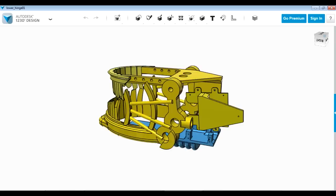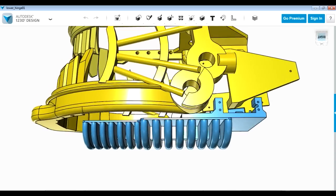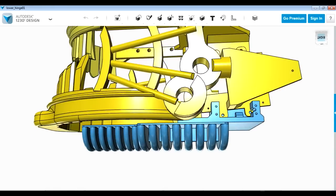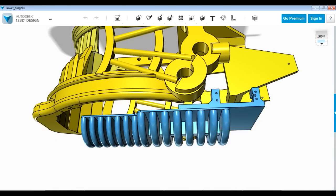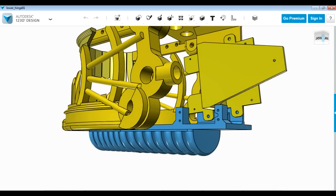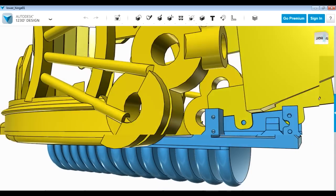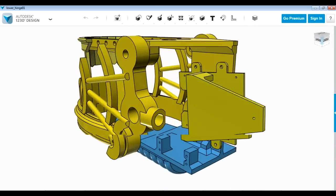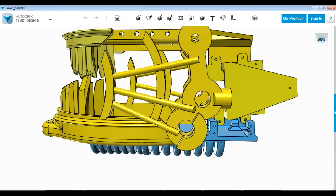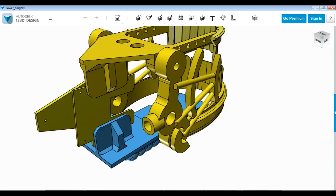The yellow parts are what I've already printed, and there are additional blue parts to print at the bottom. We've got a knurling piece fitted underneath, which is characteristic of Alien, bonded to the bottom bracket — essentially a mirror of the top bracket. There's also a servo mount in the bottom corner so a servo can push the bottom pivot on the jaw to open and close it. I'm not sure if a standard servo will have enough power, but the jaw moves quite freely and doesn't need to travel far, so I can use a high leverage ratio.